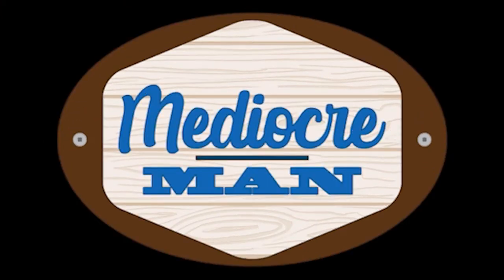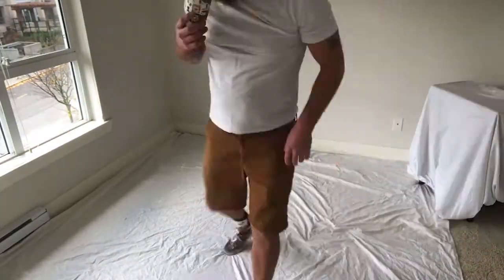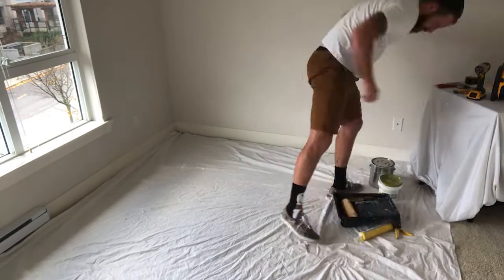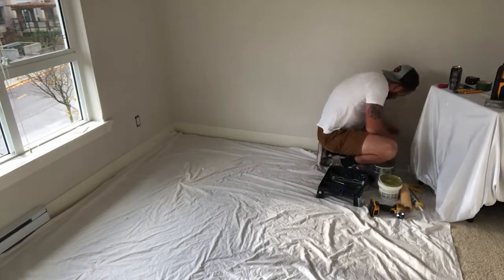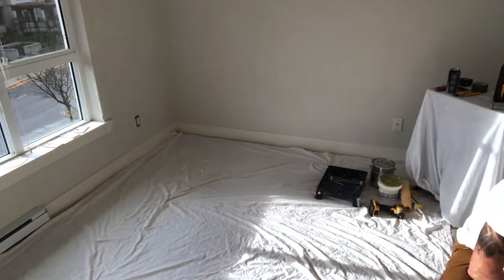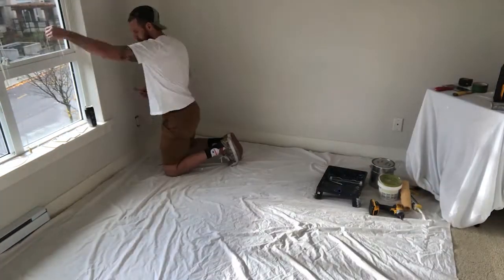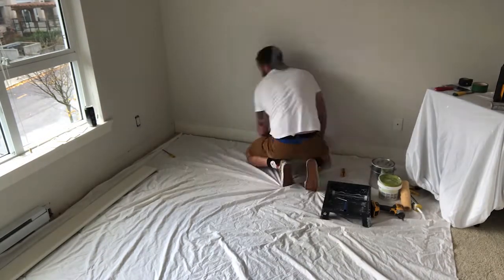First things first, before last things last, get the drop cloths on the floor first, then get the cover plates off the wall that go all around the lights and plug-in receptacles. Then score the caulking above any trim if you have any trim on the walls, and then get the trim off the walls. It's a lot easier to paint without the trim, and then start mudding.